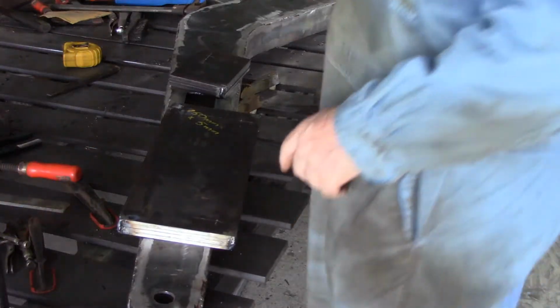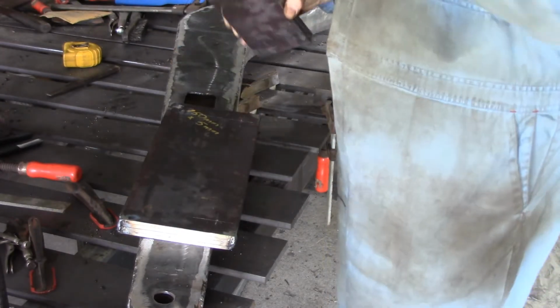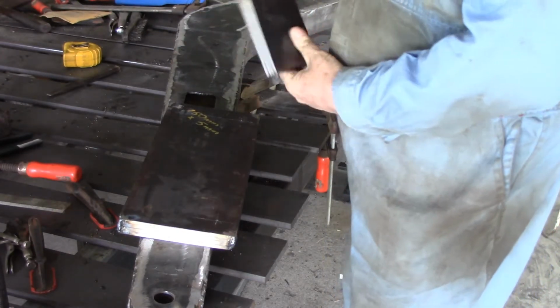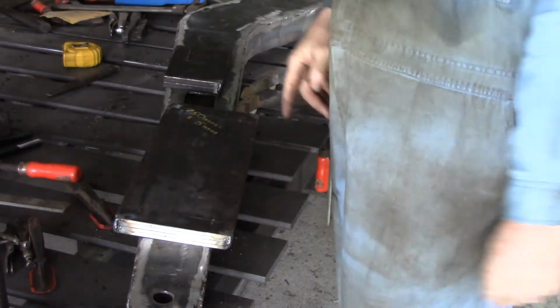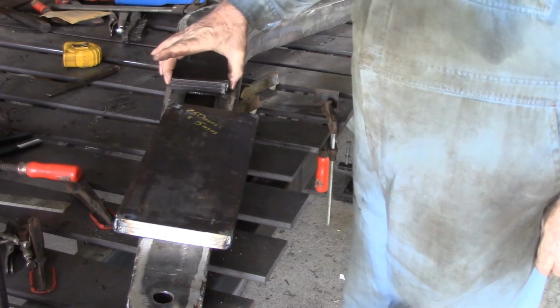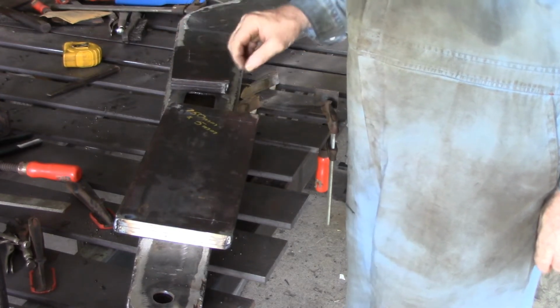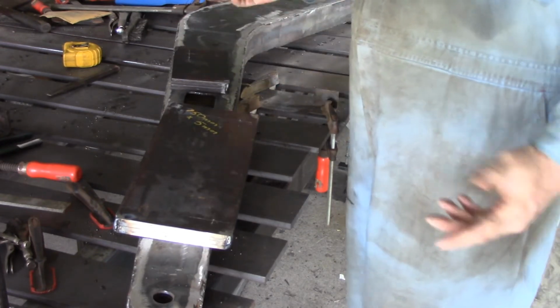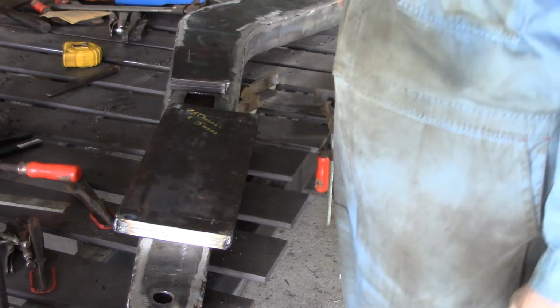I've got 4 blanks each for part 029 and part 032 here. Making 4 of them together, I've tack welded them at the corners where the tacks will get cut off in the natural course of events. This is the right width here, but it's too long this way, so I'll be cutting it off up here, but I'm going to drill it first. The extra material, that's the size I had, and it'll give me something to clamp to on the drill press.